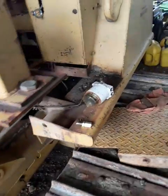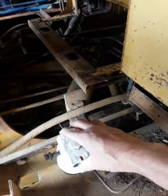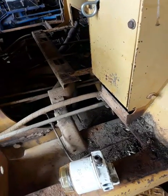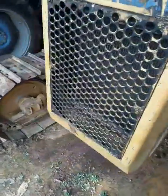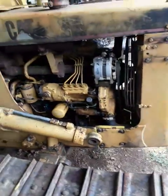So I'm planning on putting one of these — this is the fuel line from the tank going over to the lift pump. I'm going to put a bracket right here and hang one of these little Racor water separator filters right here on that bracket. It'll be under this floor plate which lifts up, so you've got a bunch of room in there and it's pretty well protected. But gee, I was really surprised that that thing didn't have any better strainer before getting to the lift pump than that little tiny screen.